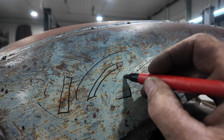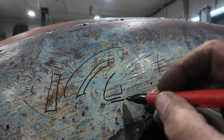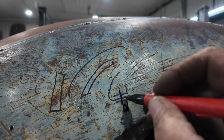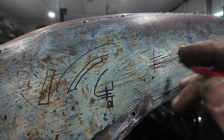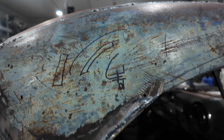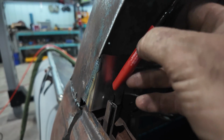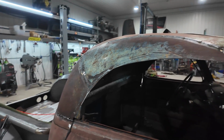What I want to do is take the vinyl and wrap it around. We can glue it, but I would like to have a second piece that comes down, which we can put our rubber on, and I can run a screw through, and it'll sandwich the vinyl in there. That's my thought, because then I have an extra element that I feel better about, holding the vinyl all together. And then this channel can rest up against this rubber seal that I screw in, and this is a removable piece that I can take out if I had to. I don't know why, but we're just going to make it a two-piece that way.